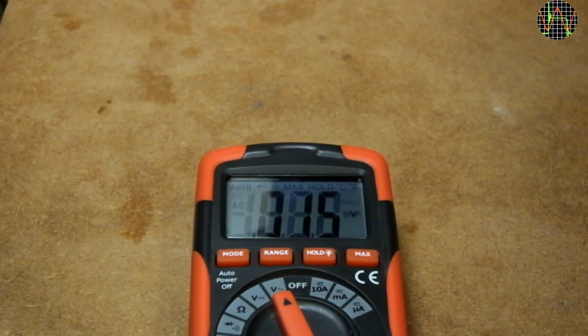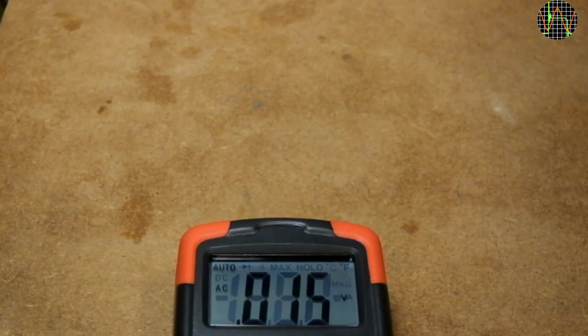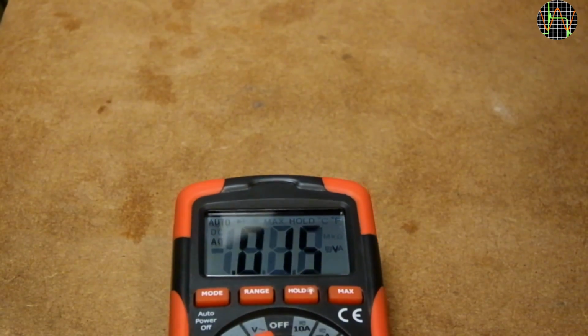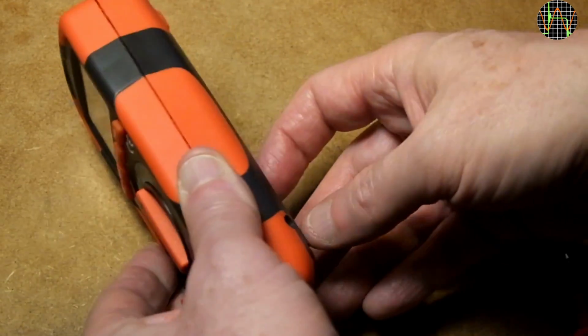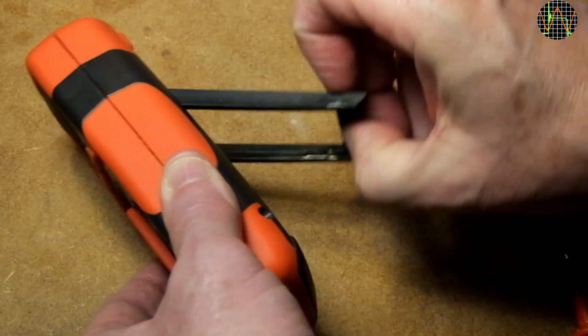Ghosting goes away if you reduce the angle and look straight onto the display, but if the angle is just slightly longer, for example, looking at the meter lying on the table from a normal, easy within reach distance, the ghosting is so bad you can't read the display any longer. So more likely than not, this meter needs to be propped up on its tilting bale, which, because it's still new, isn't the easiest to get out.